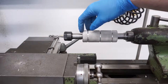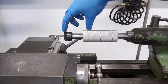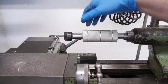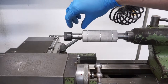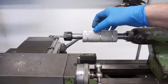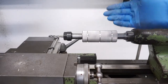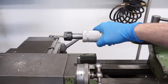One thing here — and that's another reason why I wanted to make the BXA holder — it's too large here. This collet adapter was also quite long and I didn't want to cut it down, but as you can see it's sticking out too far and I don't really like that. So I'm going to make the actual holder a little bit longer for the BXA holder so it's just covered in there. But as I said, you can use this as a general reference to build your own holder for whatever tap or die feature you want.